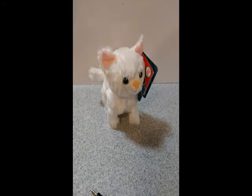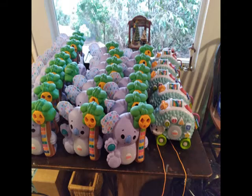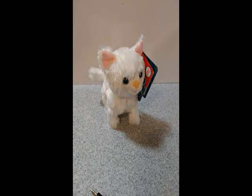What I should mention: when you open up your cable, you may have multiple colors in there because manufacturers make cables with whatever wire is on hand. No one is going to see them; nobody cares as long as they make the connection — color doesn't matter. So you may find white, yellow, red as we did, or white, black, red; black, white, blue; yellow, green, blue; yellow, white, green — whatever the combination is. It doesn't really matter. You just need to find the two wires that do not activate the toy. Make sure they're separate, and then the third wire standing alone becomes the other side, so you can make a mono cable out of that stereo cable.